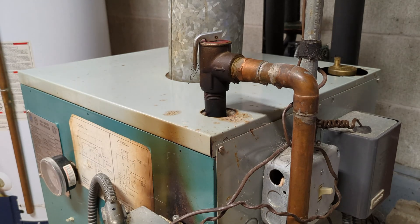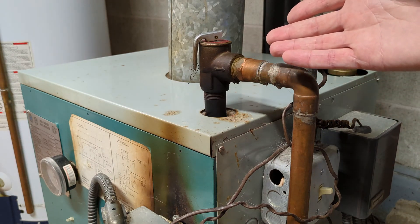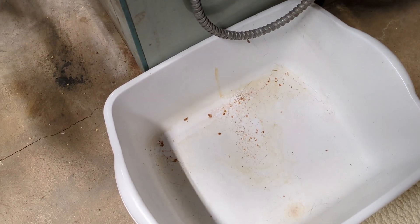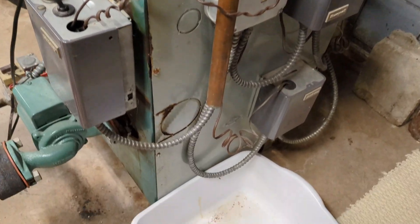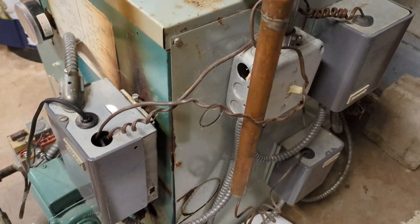Now, what I would consider normal drips and leaking from a pressure relief valve — this one here I've owned for at least 10 years. You have your bucket under the drain here, and you can see the highest level it has ever been is just a small amount in the very bottom of the bucket — maybe half a cup of water at the most. If your bucket is actually filling up, that's the point where I would replace the pressure relief valve.